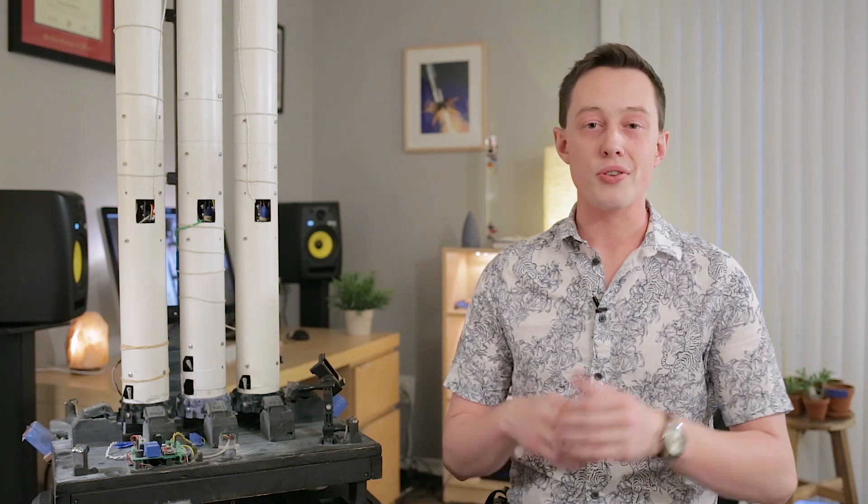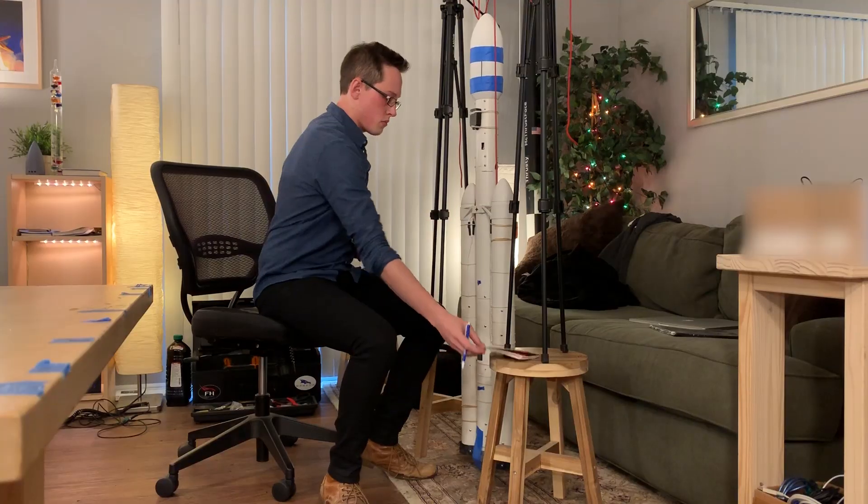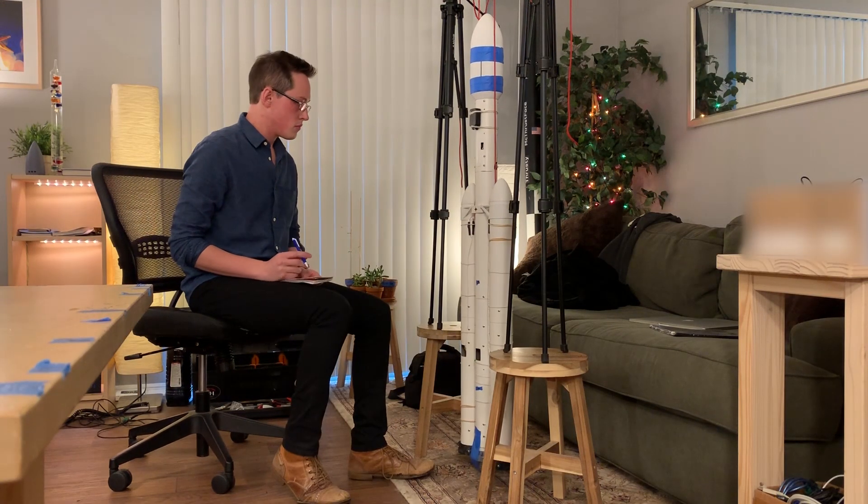After this lengthy process, there's one more step to go, and it's vehicle tuning for flight. This means that we take the vehicle, we measure a bunch of things like its mass moment of inertia, the distance between the center of mass and the thrust vector control mount. These are all nerd words, but the point is we're trying to simulate the flight to see how it will perform when we actually hit the red button — it's actually a silver switch, but who's counting?